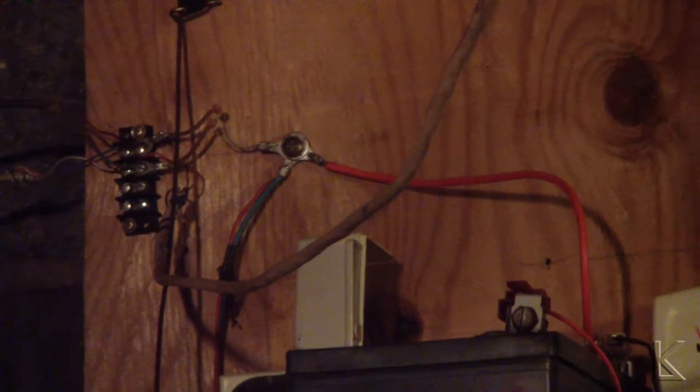Okay, we're grounded — you can see the ground point there. I know that wire is red and it's going to the negative of the battery. I'm going to put some black tape on it at both ends to remind me and bring to notice any future technicians that it's actually ground and not positive — I just didn't have any black wire. I've got the two caps going over to the phone lines, and the third wire passes behind that plate and ties to the metal box on the power outlet, which is tied to ground on the source. So we are now grounded electrically to the house ground. I'm going to go upstairs and we'll look at the radio and see if it's any quieter.